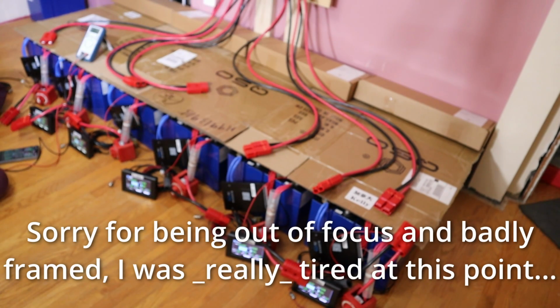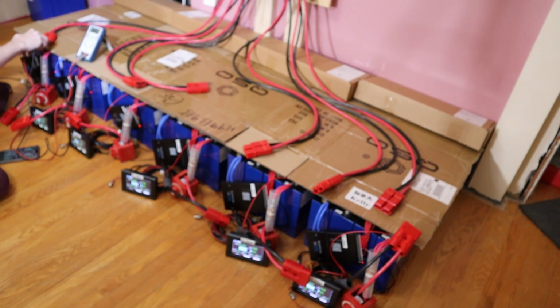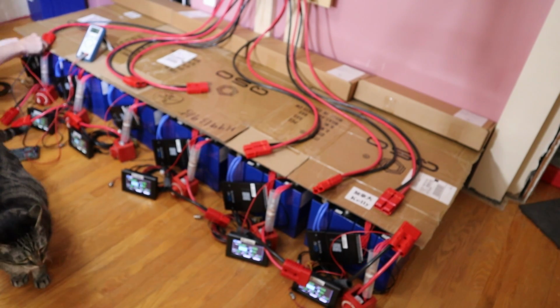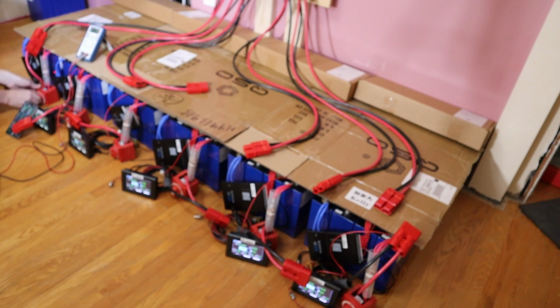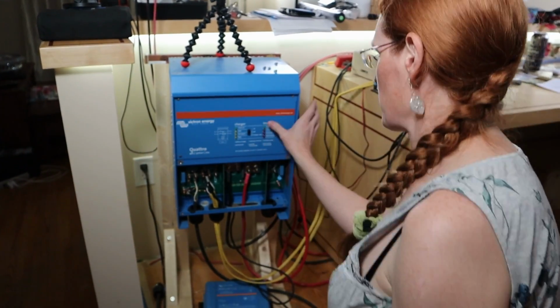So right now, this should actually have the same voltage as the inverter. Yes, it's 24.4 volts. If I press and hold the pre-charge resistor for 5, this should now be back up to 50-some volts, 48 volts. Okay, let's turn this on before the pre-charge resistor is dropped out. It hasn't popped yet. Oh, I was pointing at the wrong one. Sorry, being a little flustered, I'm not doing the best recording.